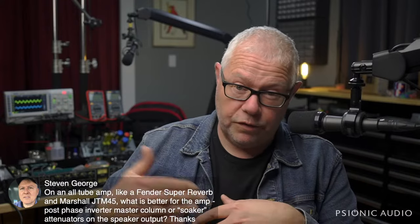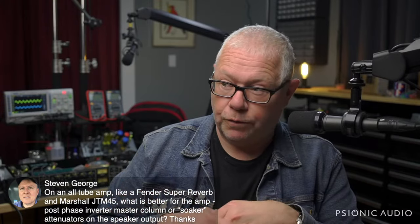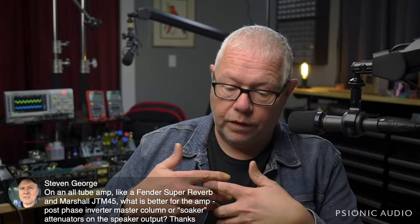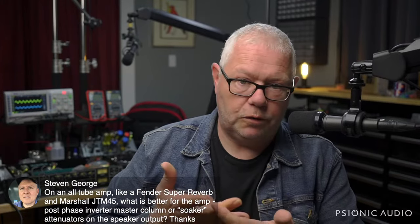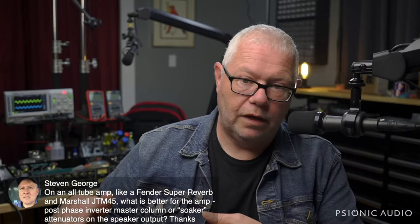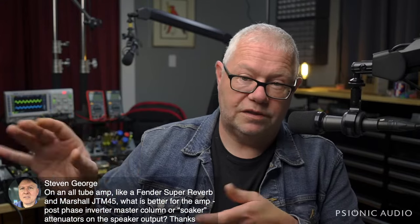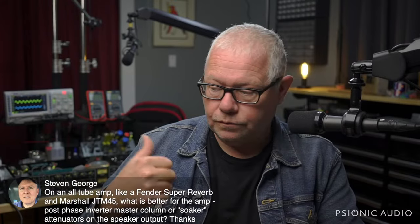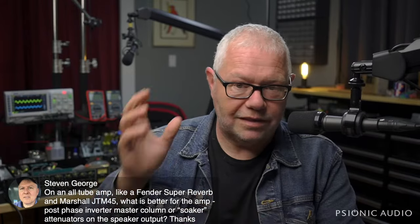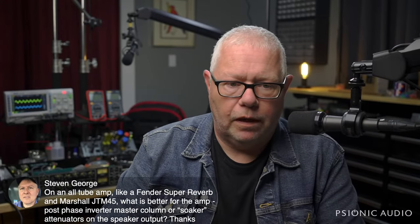Then you're just left with, are the speakers moving enough? Are they efficient enough to move at the lower volume? And is it at a level where we still hear it correctly? Look up Fletcher-Munson curves, because you can turn it down and you think, oh my God, that lost all its low end, it lost all its highs, it's real boxy. That's not the amp failing. That's how we hear those same sounds at low volume. It gets complicated.